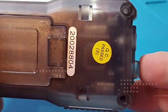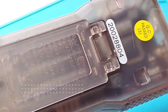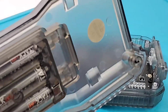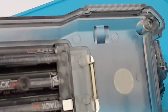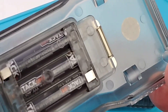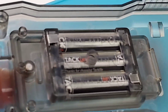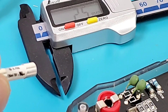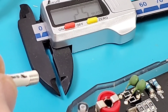Closer look at the back without the holster — look at that, you can see the IC with the chassis attached. Very nice. If only they'd put a little LED in there to light it up — that would have been truly awesome. Teardown time: no shielding on the back, but that would have blocked the see-through effect, so we weren't expecting it. Three triple-A batteries power the Taclife. Very nice translucent molding, high quality plastic. Something you don't see every day: a 750 volt fuse on the milliamp range, 250 milliamp rated. Nice.